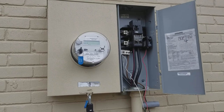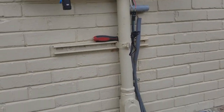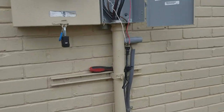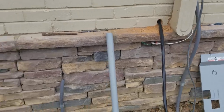Here is the main meter on the outside of the house. We're going to go in, tap in, and run a feed line. You can see it's coming down here. We're going to run a line right out of the box here, right out of the meter before it goes into the house, then go down and through the crawl space, which is down here.